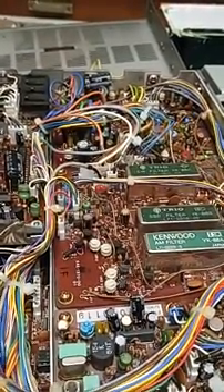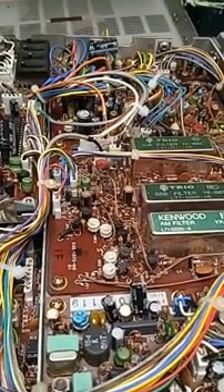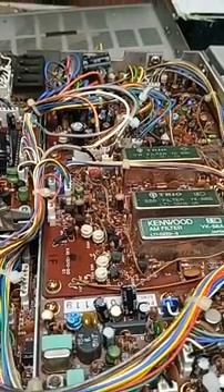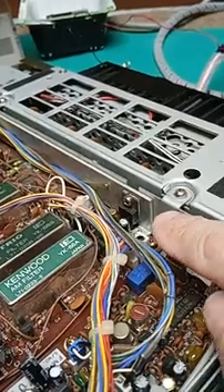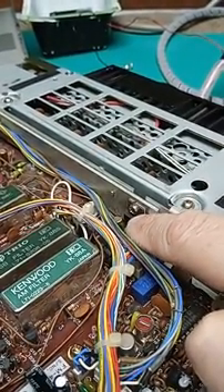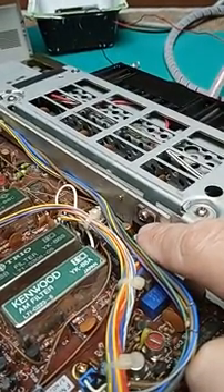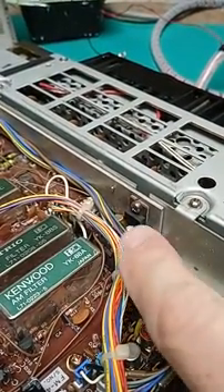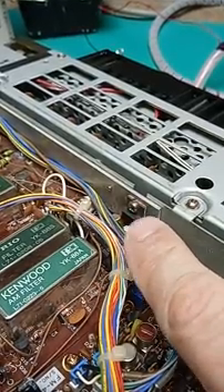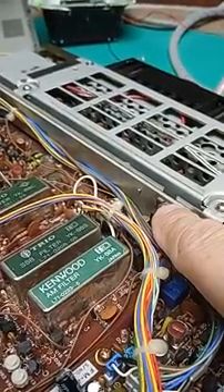That was cleaned with toluene. There's an art and skill required to replace a couple of capacitors, but a procedure is needed to replace 125. With each board out, each heat sink contact has to be renewed — transistors or ICs taken loose, insulators removed, old heat sink grease removed, screw threads cleaned, re-greased, properly tightened with very little torque, and Loctite on the threads so they don't come loose.